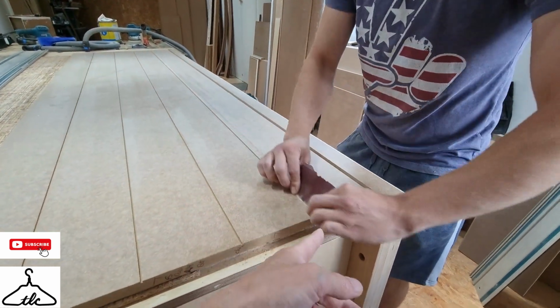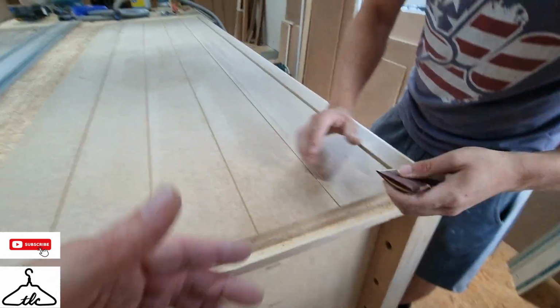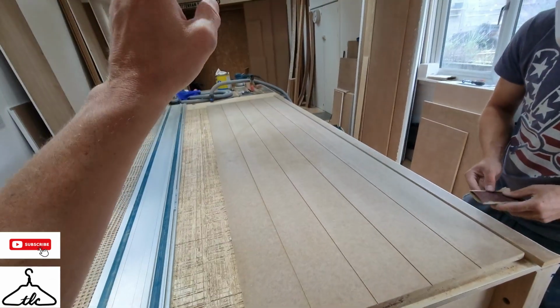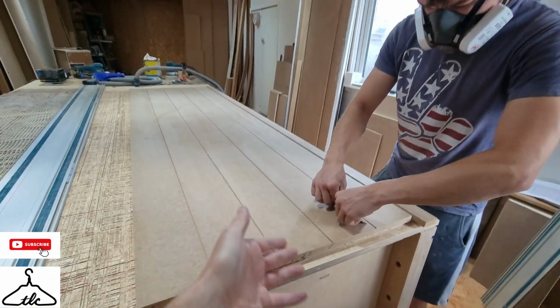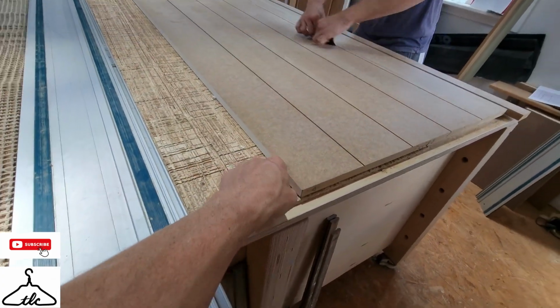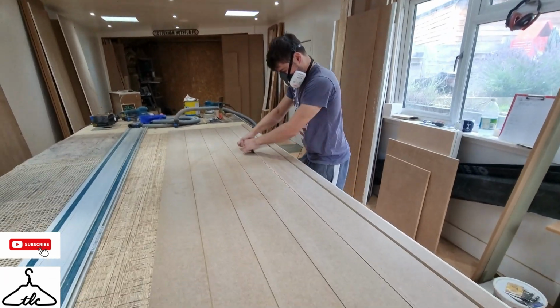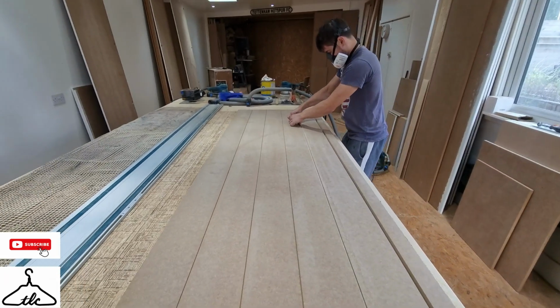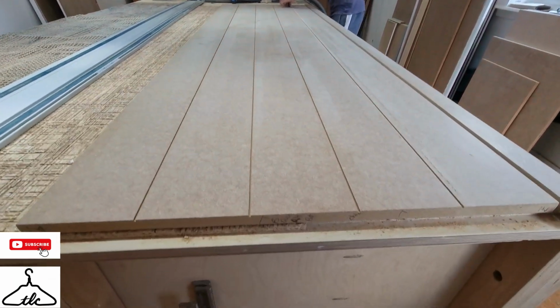No machine's going to go in there. Take those little sharp edges off also, and then he's going to do the other side. Once he's done that, it's just going over with the orbital sander, P240, and job done. These have already been hinged and edges have already been treated, and arris is taken off, all marked up, ready to go. This was the last treatment. So once Sean's just done these little procedures with the sandpaper and the orbital, it's all finished.